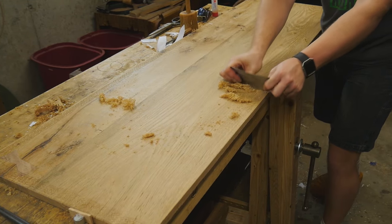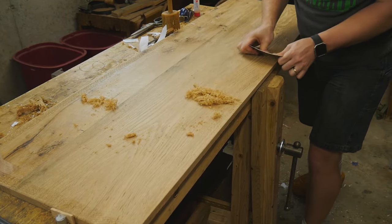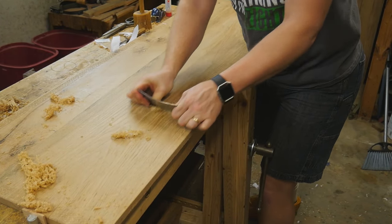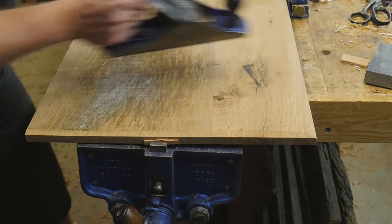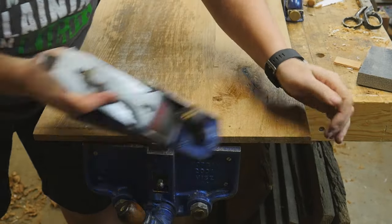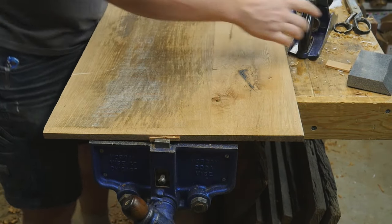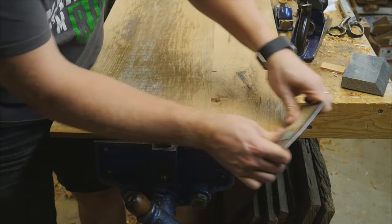Once all that's done, it's time for the final smoothing of the top. Most of that is done with the card scraper or cabinet scraper — I'm going through and looking for any areas with tearout, removing those and getting it finger smooth, ready for the final edge before finish. A cabinet scraper does really quick work with this and you don't have to worry about sanding or dust. Just beautiful tight curls. The last thing I'm doing to the surface is on the bottom side — putting in a very heavy chamfer to make it look like a little bit of a reveal. I'm bringing it down to only a half inch thickness on the edge of the board that you can see, which makes it feel a little bit lighter. With all the other beefy elements in the build, I thought that would be a nice touch. The card scraper gives it a nice clean surface and away we go.